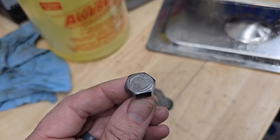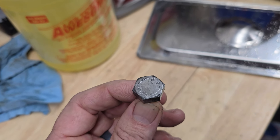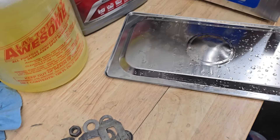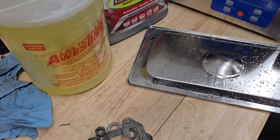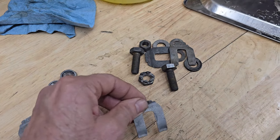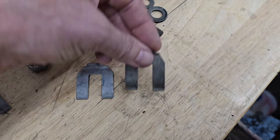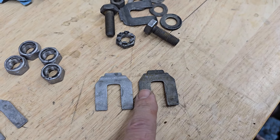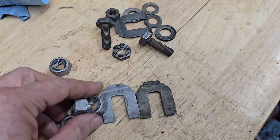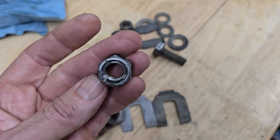That white wire wheel finish is more like the head of this bolt that I actually hit with the wire wheel after using the Evaporust in the cleaner — this is really what we're going for. This gives us a really nice finish when we have them zinc plated. After the Evaporust, I put the pieces in pure concentrated Simple Green for about 15 or 20 minutes. You can see the ones that went back in after the rust was gone — they look pretty good, and this would probably give us a nice coating with zinc.